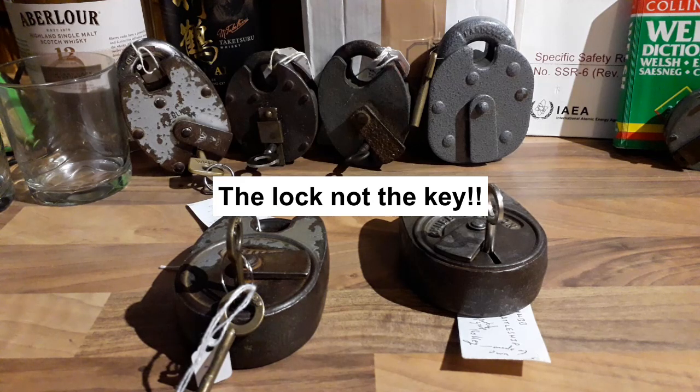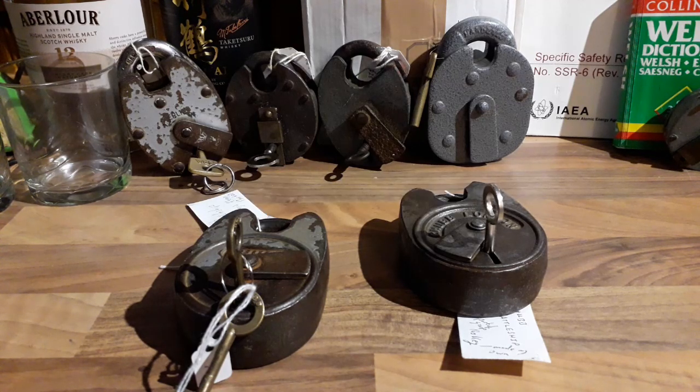This leaves the lock open to being very simply bypassed by inserting a pick wire and moving the bolt. So hopefully that's of interest. That was patent 445444 by Chubb, and although designed within the patent for cabinet locks, the only places I've ever come across monitor levers are in the Chubb battleship and the Chubb cruiser — both padlocks. If anyone has come across monitor levers in cabinet locks or door locks designed by Chubb, I'd be fascinated to hear about it. Good night.